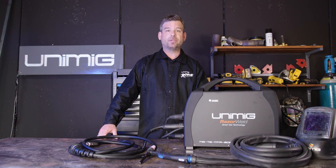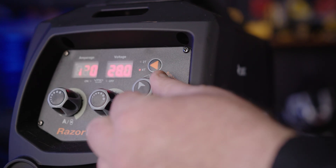As an added bonus, this program can be used with 0.8 and 0.9 mild steel wires, also with argon gas mixtures with or without oxygen, that can be easily interchanged with a flick of a selector switch.